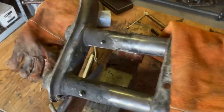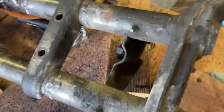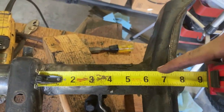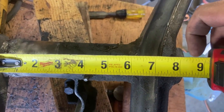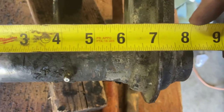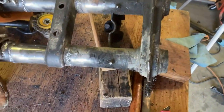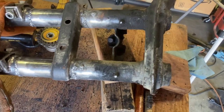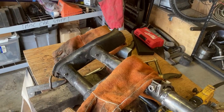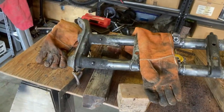All right — one side's done, nothing over here yet. Please don't give me crap about my welds. They're an issue, I understand that, but I am confident that they are strong enough. Right here I'm supposed to get to six and five-sixteenths — boom — and then down here, easier to see with that white background: six and like three-eighths. So maybe a sixteenth of an inch off. That's more accurate than I was expecting to be, and I'm probably more amazed than you guys are. That side's next. You can see how much shorter that is compared to all of that. Progress. Ugly welds.